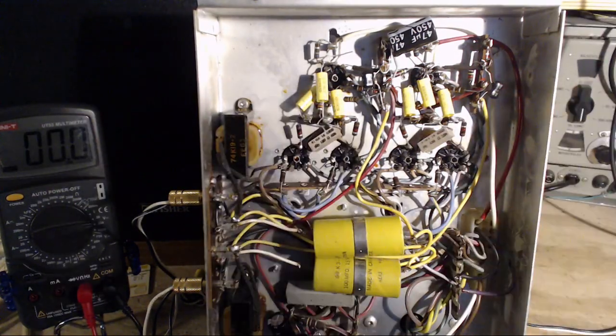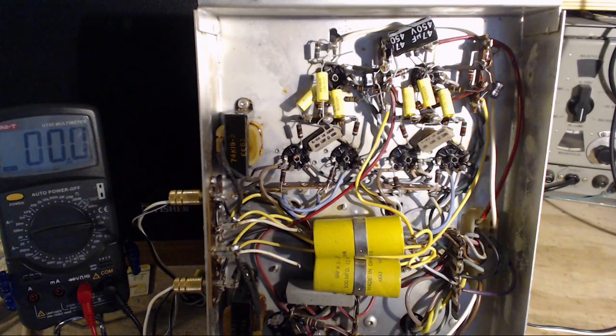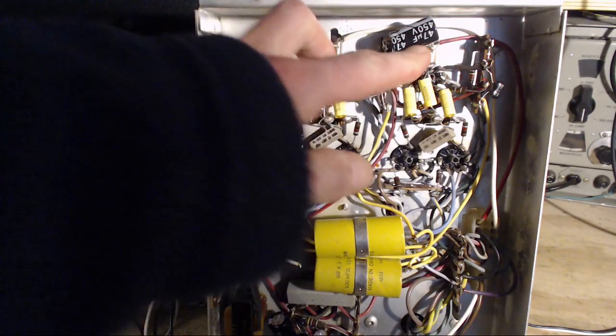This side used to have a big oscillation in it. That's all gone now because I altered the speakers. Still hearing a hum, but the hum is only in one channel. Swapping tubes. Never mind all that other nonsense. Maybe there is a bad tube in here, even though I tested the living daylights out of them. Okay, we'll swap the two input tubes.